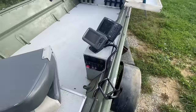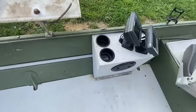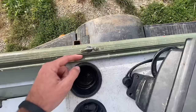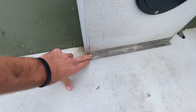By far the most common question is how I built this little console and what it's made out of. Honestly, that was probably the easiest thing on the whole boat — it's just half-inch plywood. I basically just made a box, put some wood glue in the seams, and put some small tacks in it to hold it until the glue dried. I've got a couple of stainless screws going through the gunnel down into it. I slid it back under the gunnel and put some screws in. I do have a piece of aluminum angle at the bottom — that was the best mounting solution I could come up with. I messed up and put screws right in the seams here, and over time it kind of spread them out — I've been meaning to fix that.